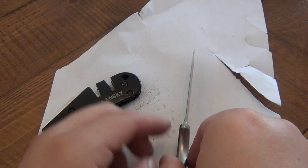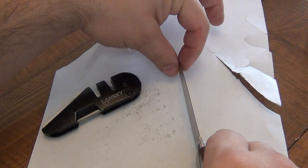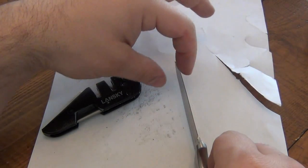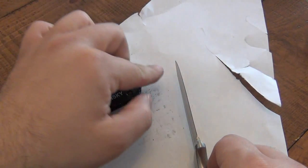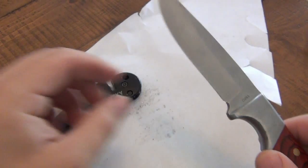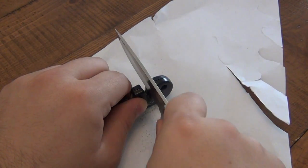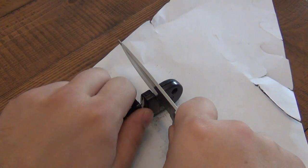Get this to stand up. I'm grabbing both sides. Right, here's the carbide sharpener. I'm grabbing the edge, and I'm just getting a hold of that metal and just tearing off a strip. That's basically what it is. It's tiny little strips being torn off, as opposed to shaping it and finely sanding each side so that it comes to a more acute point. I'm just grabbing both sides and, there you go. So let's do a couple more passes here. I'll show you what kind of edge we've created, and then we'll refine it with that ceramic rod.